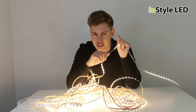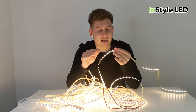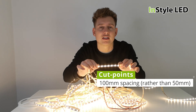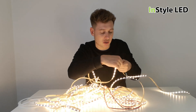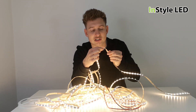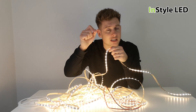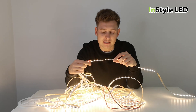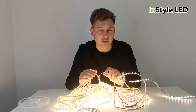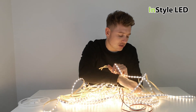So what are the disadvantages of this LED strip? For smaller areas — which is probably why you wouldn't be using this anyway — the cut points are now every 100 millimeters rather than the usual 50 millimeters. So if you're going close up to a corner and bending around it, cutting and soldering, you may have to go back to the nearest 100mm or go further to the next one, rather than the 50mm. That is probably the only negative compared to the usual strip.